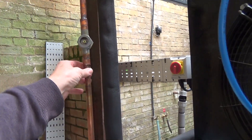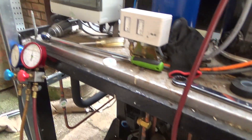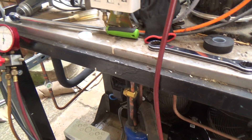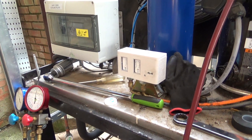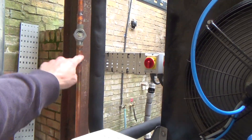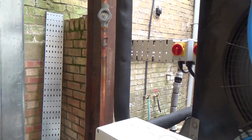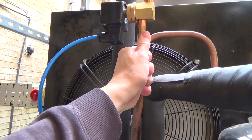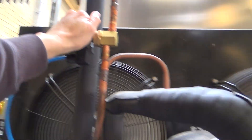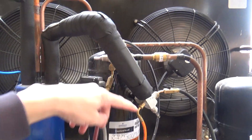It's very nice and clean - we did a nitrogen purge while we were doing the brazing on this. We don't always do it if we've got something that's 30 or 40 years old full of grime. On a used system if you've got refrigerant in there, you're not going to get any copper oxide anyway because it's full of refrigerant and there's no oxygen. So there shouldn't have been anything in there. Like I say, when we fired this up it was a bit noisy to start with, so it did make people wonder whether something had gone through.